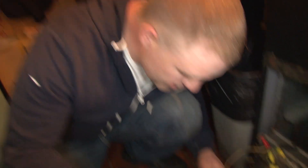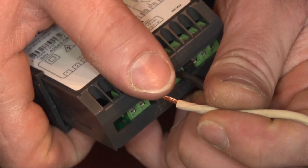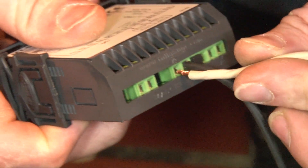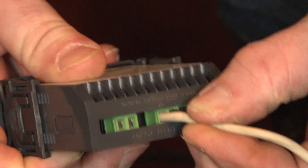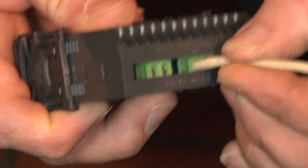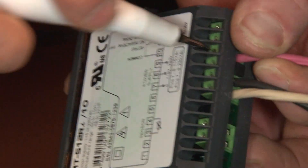I'm going to prep these wires for connection to our controller. You should have about six millimeters or a quarter inch of wire exposed — that's a good rule of thumb because once you put it in the terminal, the conductor accommodates the full depth of the terminal, and the insulation on the wire butts right up against the insulation of the terminal block. That eliminates the possibility of a short circuit. That's it for our connections.